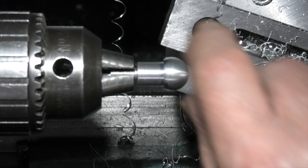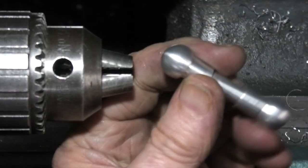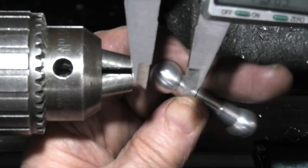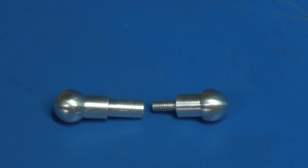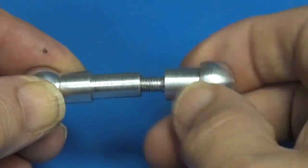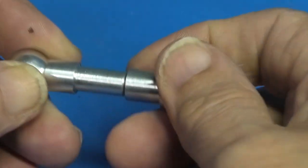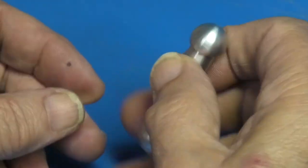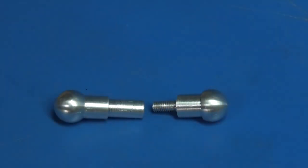I think that's about the best I can get that one. That's the two — 14.20 on this end, 14.35 on that end. These are the two pieces we made: this part screws inside, and that's the handle finished. And to find out what it's for I'll finish off the next part in the next video. Thanks for watching, I hope you enjoyed it and we'll see you next time on E-NOTS Engineering.